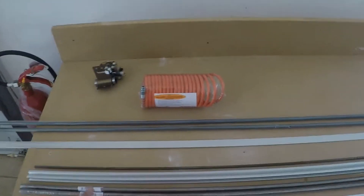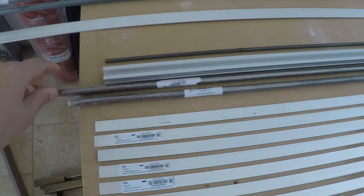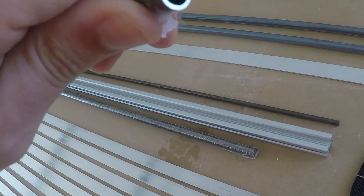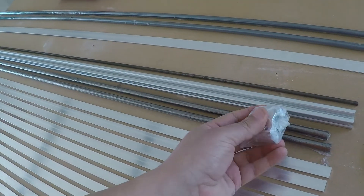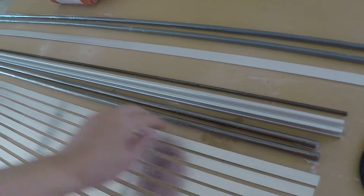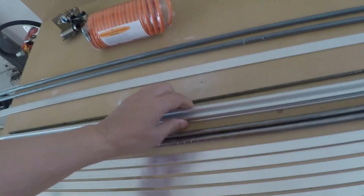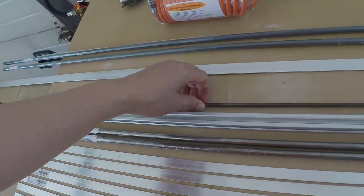On the sides it will be finished off with some wood. For the Y axis I'm still not sure, but I have two options: either these 10 millimeter steel tubes — one millimeter wall steel tube, I would use two — and then just like a 3D printer I can use linear bearings, placed vertically or horizontally. The second option is to use aluminum extrusion. I haven't quite made up my mind, but I will probably end up testing both.